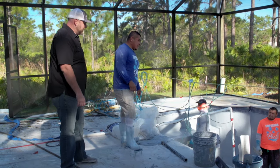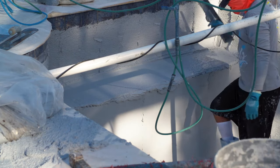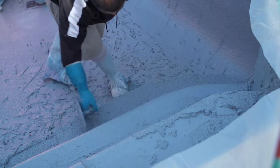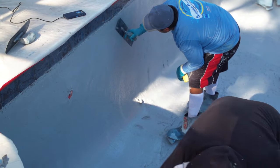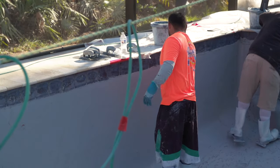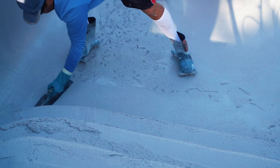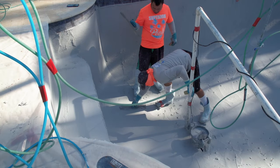Well, we just start here, put the plaster in. It's a Caribbean blue color. We just got to trowel right now — we're ready to expose it a little bit. We do our job by wheelbarrow; we don't use a pump to pump it out. A lot of different companies do it different ways — that's the way we do this. We've got to wait until we expose everything and show all the pebbles. This is the final stuff we put here. It's very important to trowel really well and tie real nice around the tile — that way it prevents a lot of leaks and problems. So we've got to keep troweling and make it smooth so it's not rough in there.